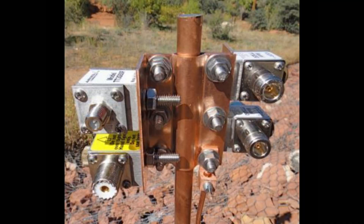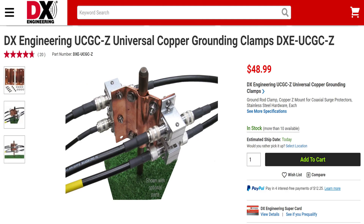You would still need to install a secondary ground rod for your shack grounding, similar to what I've done, and then you would add one of these brackets from one of our favorite ham radio distributors. This allows you to add lightning suppression and protection. You still have to bond this to the house electrical system ground rod, and then you have to take a heavy gauge copper wire over to the next device — basically a window feed-through.